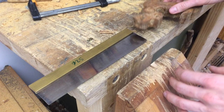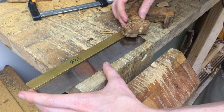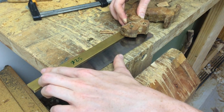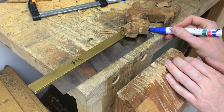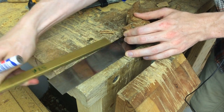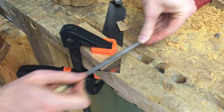Now I want to cut the angle on the blade — that will make it seat inside here. So to do that I figure I will line up the spine with the mortise and then push the blade until it visually aligns with the end of the blade slot. Then I can remove the spine and it should be right there. Looks about right — let's cut that out.